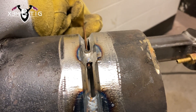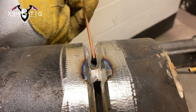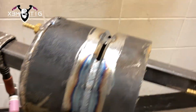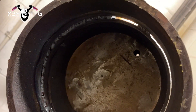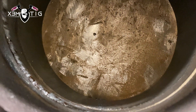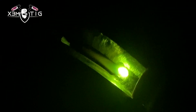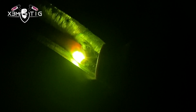Keep the rod inside, back feed all the way up. Pull it out before you reach that tack and finish it from the outside. This is the root, and that's how it should look — a nice solid root. With this root you don't have any worries about suck back, and then you can run a hot pass at 160 if you want. I like to run hot — that's sometimes good or bad depending, but it usually speeds up the process.